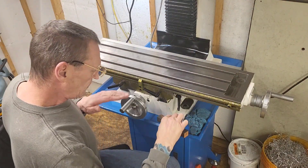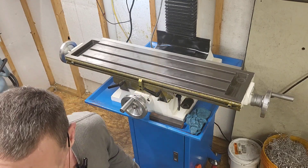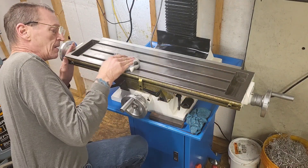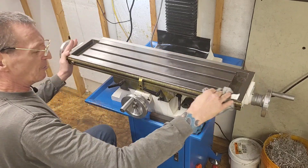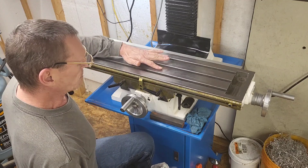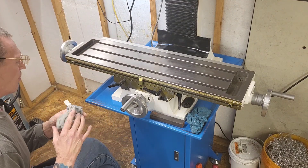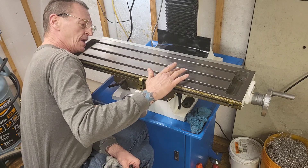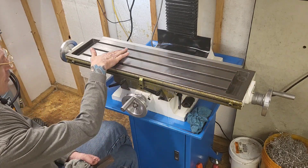My table's stoned so well this is all I need to do to it — it's done. Depending on which way the light's shining it looks all scratched up, but it's not. It's soft as silk. Now I'm going to take a rag and wipe a little bit of stoning dust off. It won't be much. I know my table's soft. But over time you'll literally bring your table in flatter and flatter. If I show the camera this way, you can see the difference between high and low spots in this table still — and it's smooth and flat as can be. These are almost unmeasurable.